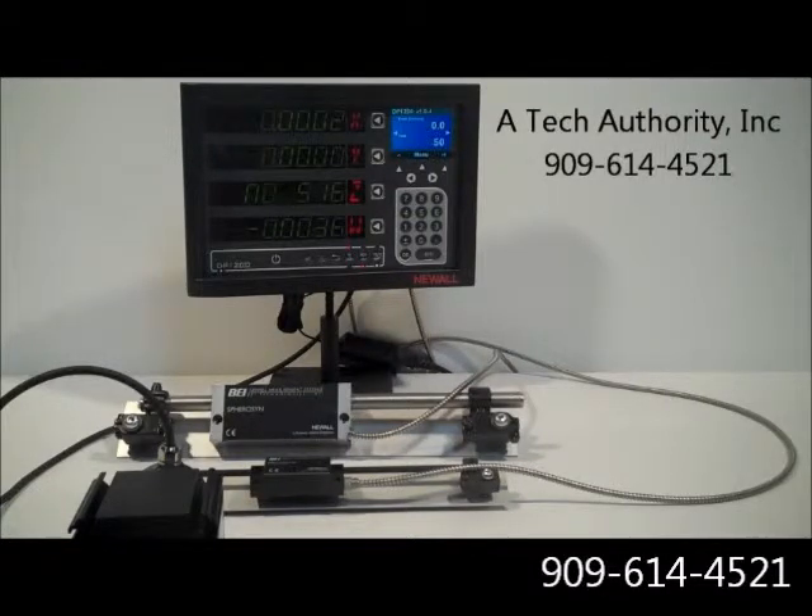Some of the features available: it's 2, 3, or 4 axis including rotary and linear. Real time toolpath graphics with auto zoom, ultra wide viewing angle, arc contouring — calculates points along the arc for rough machining — polar coordinate reading, line hole routines — calculates points along a line at equal distance — programmable memory, teach mode, tool offsets, feed rate, and linear and segmented error compensation.